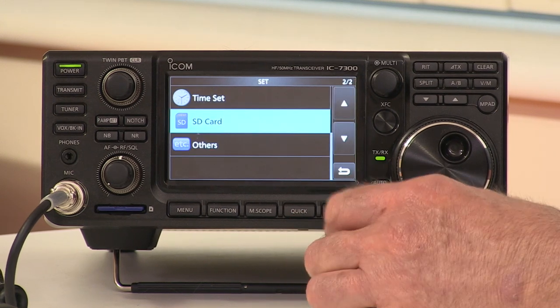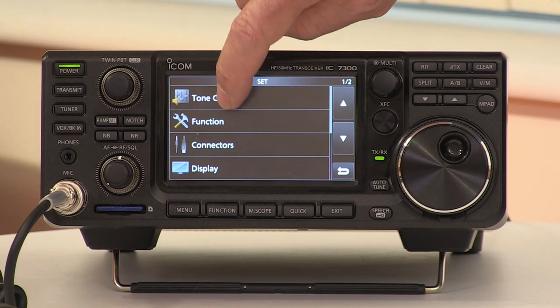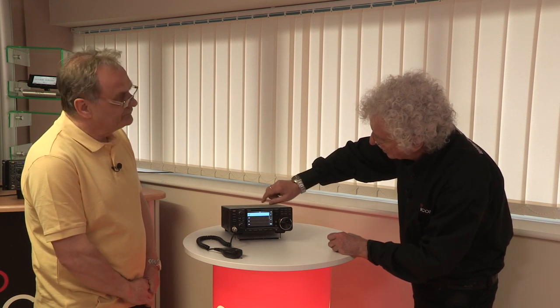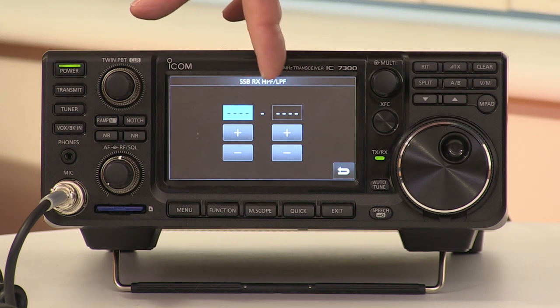Right at the top of the settings you've got tone control. You can alter the tone on both transmit and receive and tailor it on each mode. So if you go to sideband, you've got treble or bass boost, or you can reduce it. You can actually alter the bandwidth as well — rather than boosting, you can define the upper and lower limits. But really it doesn't need much change. It's a very simple straightforward way of doing it, and in the past people have got very bogged down trying to sort out audio settings.